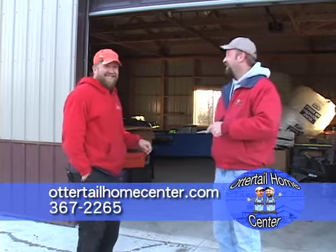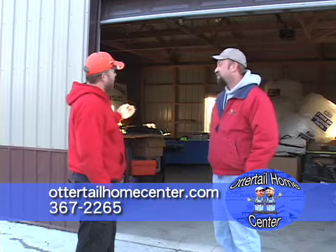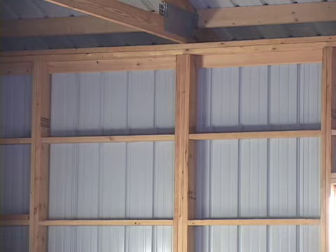Well, we're at that crazy guy's house again — he's still out hunting somewhere. Here's an example of a bookshelf frame. As you can see back there, the bookshelf frame is two-by studs together every four foot or eight foot on center. Then you've got your purlins that run in between, so your wall is an actual five and a half inches thick, on edge. And that gives you a heck of a strong wall.